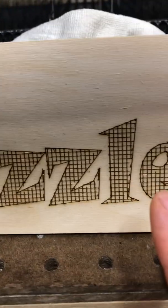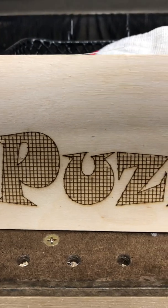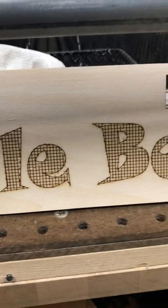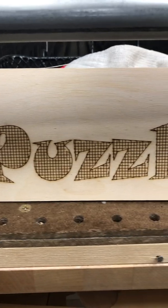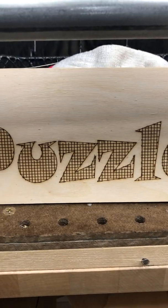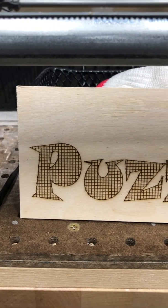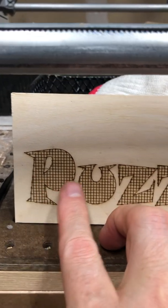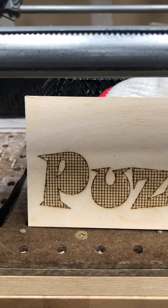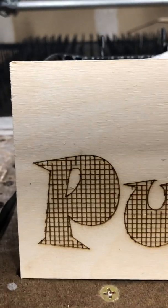On a crosshatched word it's not too bad until you start looking closely and it gets noticeable. Marlin is working on fixing this — they are adding laser-specific commands. They've primarily been a 3D printer firmware organization, but the authors are acknowledging that lasers are a thing and are working on Marlin 2.0, which would fix this mess and allow raster scanning without the laser staying on at full power at slow-down points, causing huge dark spots at the ends of raster scans.